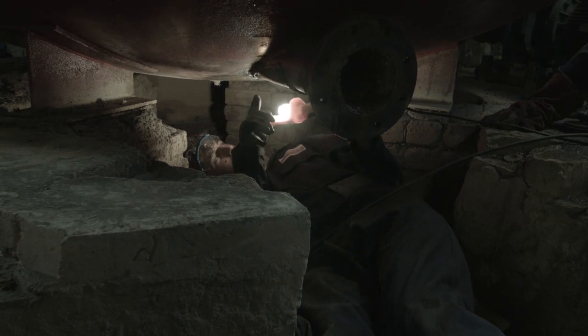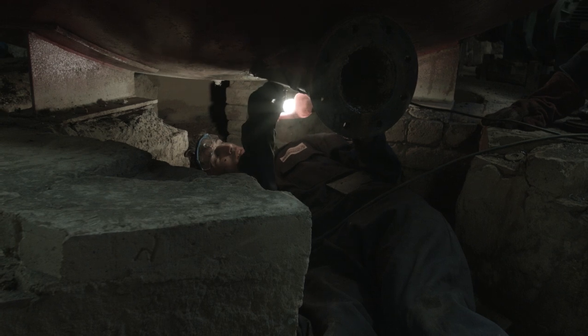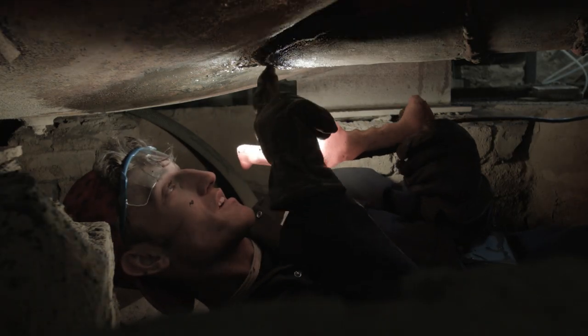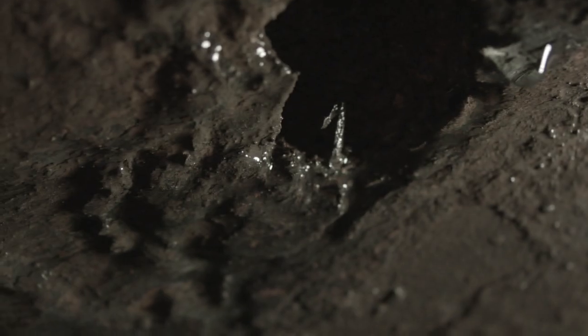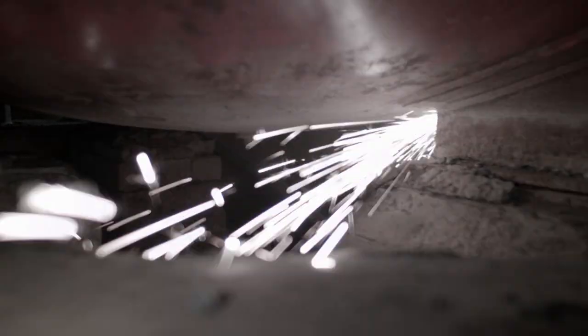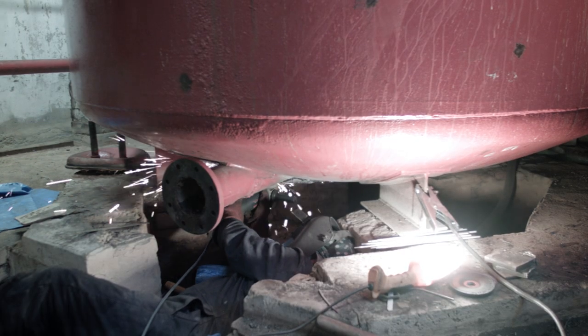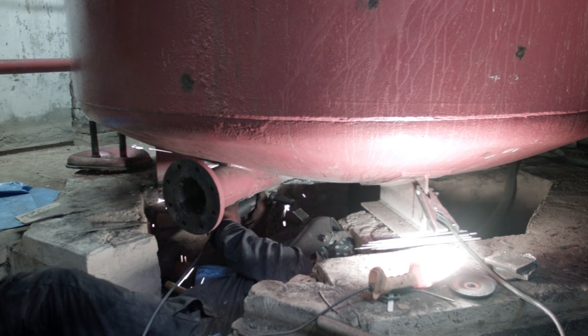What we'd done was, first of all, you know, it was 6 millimetre thick plates that was tack welded and then eventually welded onto the filter tanks. But before we actually attach these plates, we've got to dress the area down.